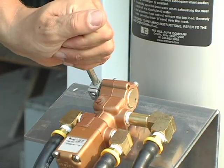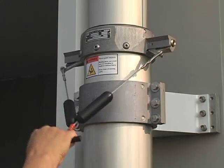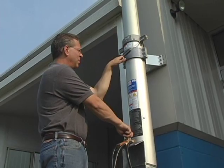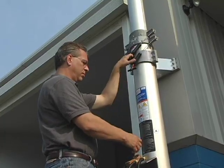Pressurize the mast to lift the load until the latch pins located on the base tube yoke assembly can be disengaged. Then exhaust the air from the mast while firmly holding down the T-handle. Continue holding down the T-handle while the first internal mast section is retracting. When this section is retracted, stop exhausting air pressure and release the T-handle.